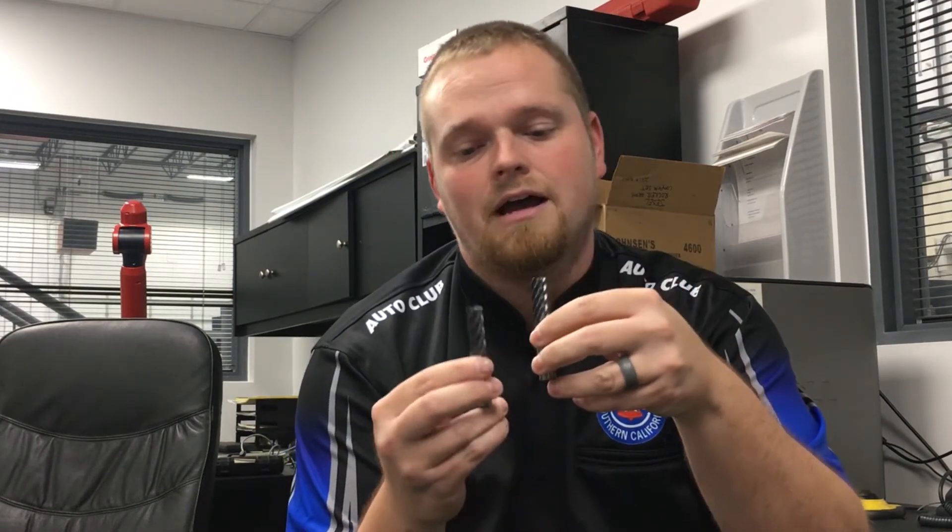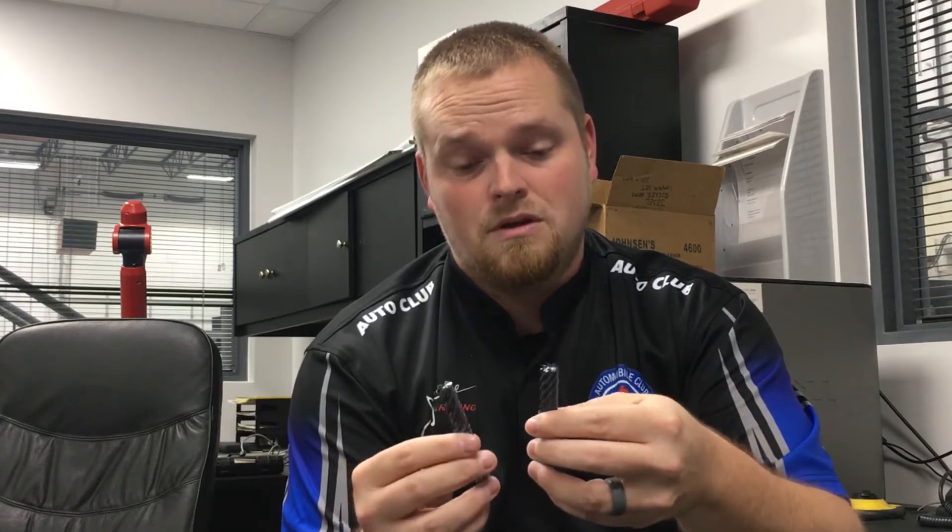On the titanium we use a lot of five flute, six flute, and seven flute end mills to machine the titanium. We use five flute extended or seven flute extended end mills like these to walk around the part and clean everything up. We use full depth cutting — full depth, smaller step overs, faster feed rates. You can go a lot faster with a seven flute than a five flute, but your step over is a lot smaller. We go about 125 inches a minute versus around 75 inches a minute.